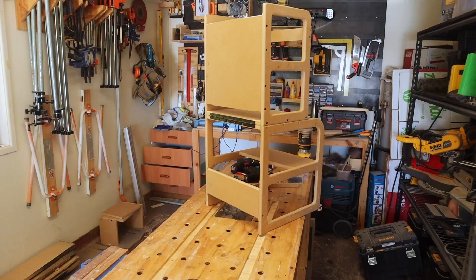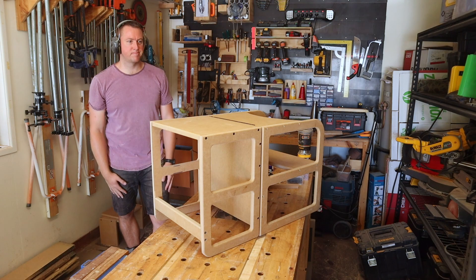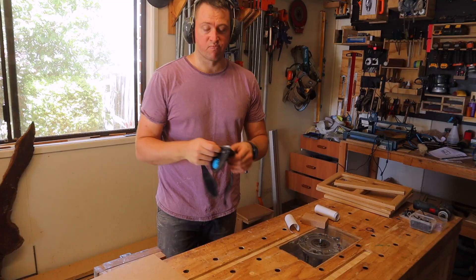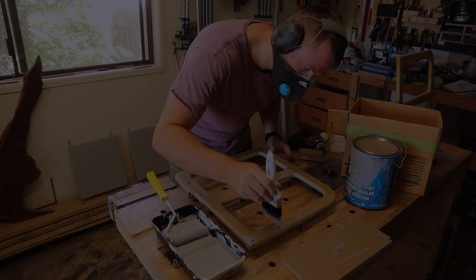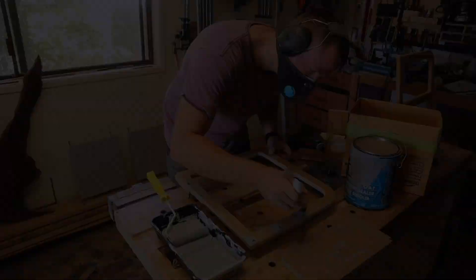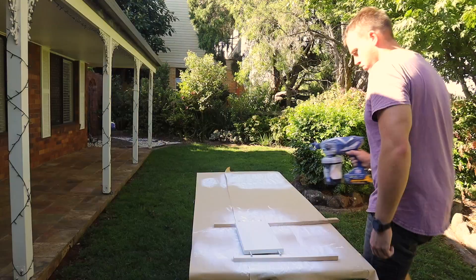And voila — we have the makings of a folding two-in-one step-stool-cum-table thing. Everything's been going pretty well, so it's time to face the grim reality nearing the end of any project: sanding. And worse than that, hand sanding MDF. You'll have to imagine your own version of purgatory — we'll just skip ahead. After sanding, I use a good primer-sealer combo and then spray two coats of a hard-wearing white enamel paint, using those screw holes to elevate the piece so I can do both faces at once.